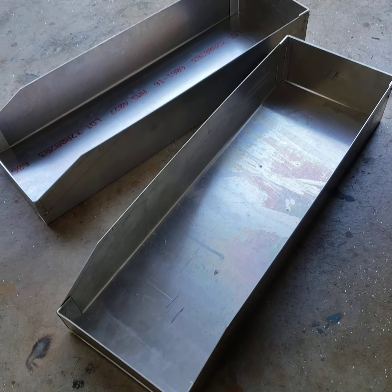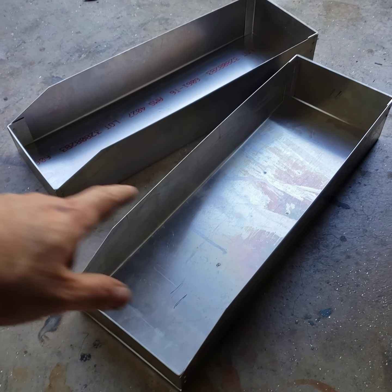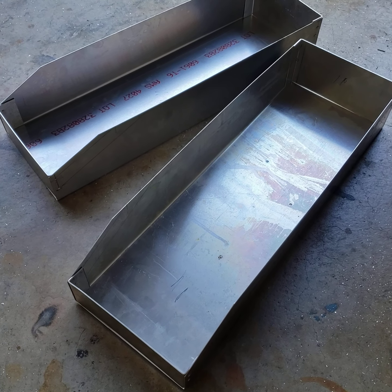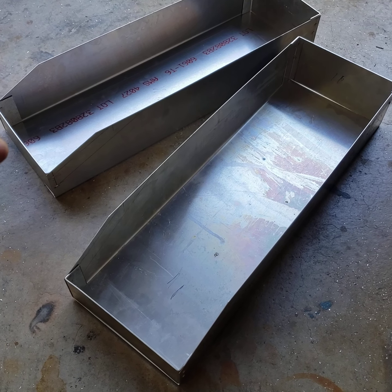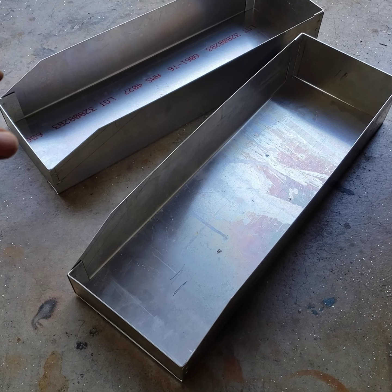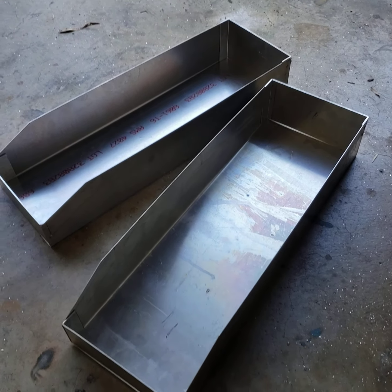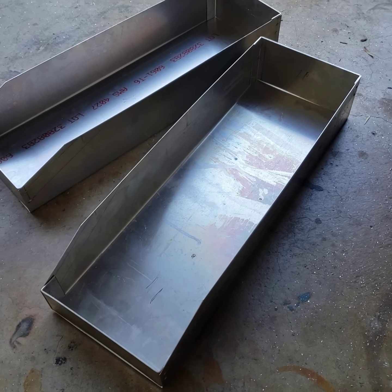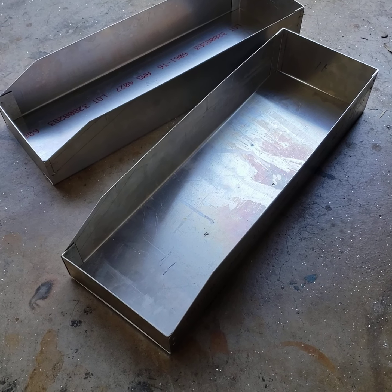To fold this up and then fold in ears you need a smaller bend tool. The one that goes on the vise is great — I have it — but it tends to cut the aluminum rather than bend it. So if you want to make these out of steel you could use really thin steel and use the bender that goes on the vise. For aluminum I think it needs a bigger bend nose because it just clobbers the hell out of aluminum. But that's this little project — it's more of a two-day project because it took me a while to cut these out. But I wanted to do this for myself.